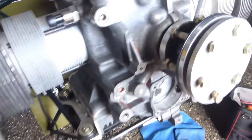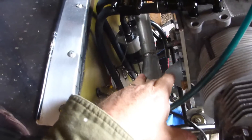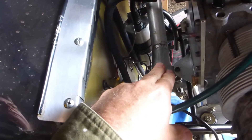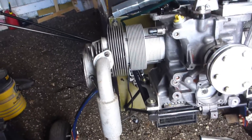I swapped out the oil cooler wrap — I did that before the engine out. What used to wrap around the intake and come in up here I've now replaced with a motorcycle oil cooler. There's some debate: people say that having the oil cooler wrapped around the intakes helps atomize the fuel and you get better fuel flow. I think that makes sense, but I'm kind of torn on it. I do like this new setup — it addresses oil leak problems. One bad blowout I had was due to a crack in that oil tube that wrapped around the intake.